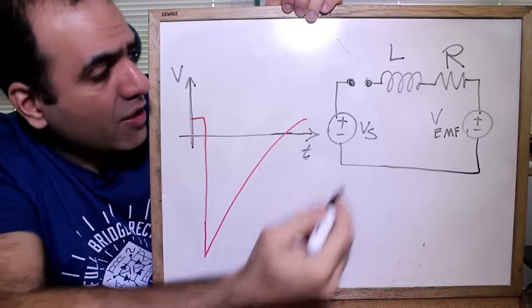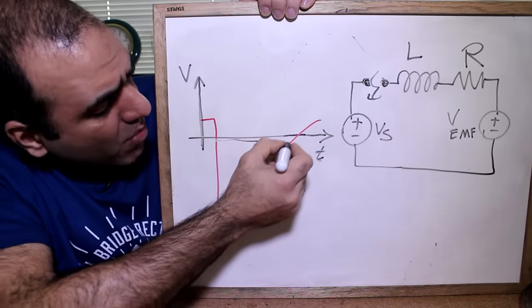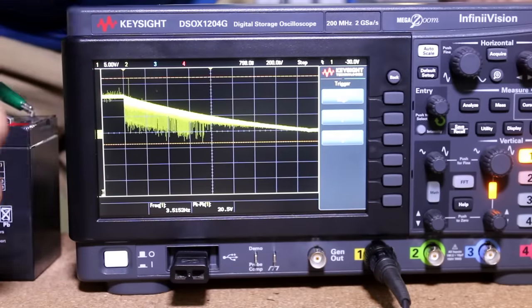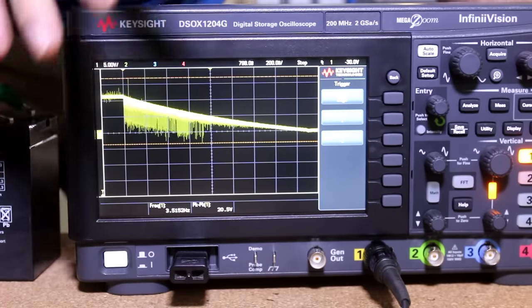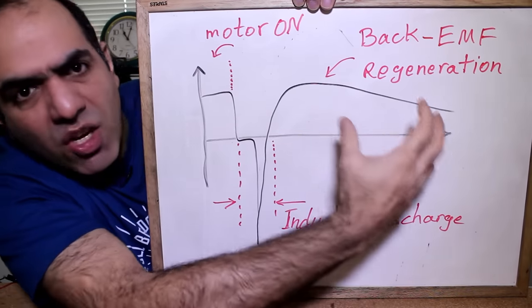When we discharge an inductive load like a motor, the inductance energy discharges creating a large negative voltage spike that can create an arc across the contacts. This arc momentarily shorts the discharge energy, initially limiting the voltage across the motor. But when the arc goes away the voltage jumps to minus 100 volts. If there was no arc the voltage would jump thousands of volts — without protection any circuit would blow up. This is one of the main reasons that commutator brushes get burned and wear away: when those brushes switch around there will be high-temperature arcs between the contacts that wear them away. After the negative inductive spike the voltage returns positive and declines slowly — this is the back EMF at work. The motor hasn't stopped yet as it has momentum.